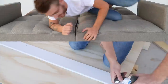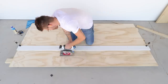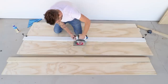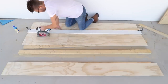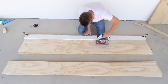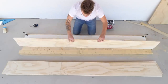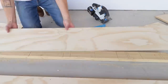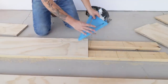Now let's get building. I've been using a lot of radiata pine plywood lately — it's the most affordable cabinet-grade option at most big box stores and it's been my material of choice on this school bus tiny house series. What you've seen me do so far is break down the sheet into ten-and-a-half-inch wide strips that I'll use to make four identical leg blanks, all cut to the same length of 68 and 3/8 inches — the same size as the futon sofa base.